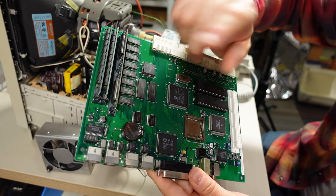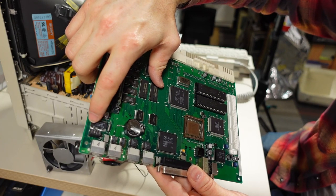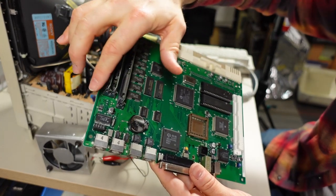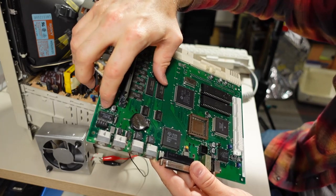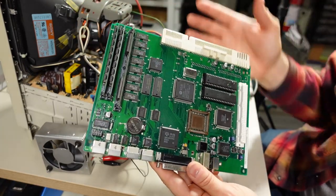As I mentioned earlier in the video, I was told that this battery is required for the board to even turn on. So with the battery on there, I did also trace out the battery voltage going into this chip and actually found the full 3 volts. It's 3.2 off the battery. Then there's a diode, a Schottky diode probably. And then it's 3 volts going into this chip. And I also saw a little bit of other activity on it. And that's while this thing is out of the computer. I assume it's running the real-time clock.